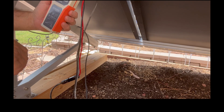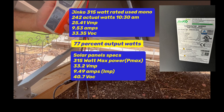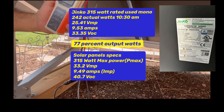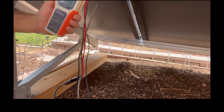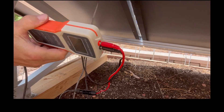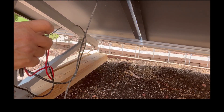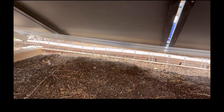We plug it in, it's lit up and starting to work. Going to manual, we are getting 242 watts, 25.41 volts, and our amps are 9.53. Our VOC is 33.35. That's a pretty good panel for $22 — we're getting 240 watts. Apologize if it's not on screen; it's a kind of tight area and really tough to do.